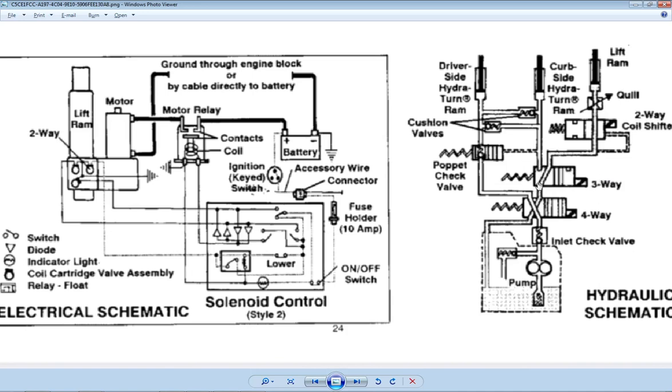This is the common port here on the bottom. This valve, as drawn when it is off and de-energized, has the common port connected to the rightmost port in the drawing — it may not be the rightmost port on the physical valve, but it's the rightmost one in the drawing. When you energize the coil on this valve, it is going to shift this switch over here and connect the common port straight through.